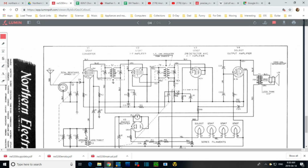So if we look at the schematic carefully enough here, we have the tuning capacitors. There's that series capacitor. I have the tuning, this is a fixed one. There's another tuning. Here, down here, are 3 trimmers. 3 trimmers on the local oscillator. 4, another one here. One of these is not a trimmer. One of these is the actual tuning capacitor. Maybe this one, C4. Wow. Well, you know, there's a lot. 1, 2, 3, 4, 5 things to tune here. Maybe this is the reason why this radio doesn't work. All this stuff is out of whack.